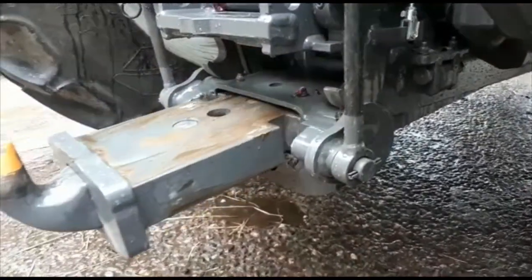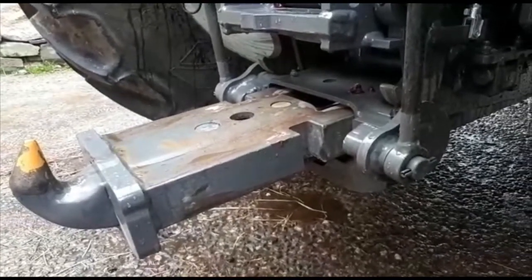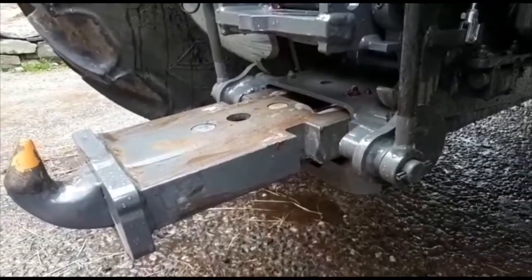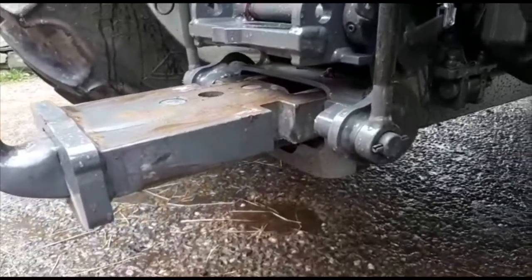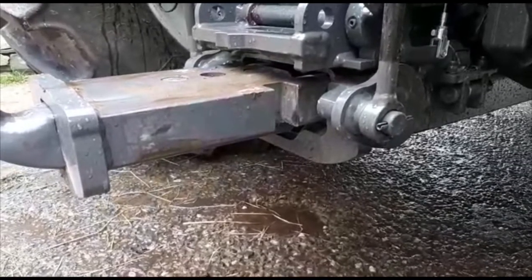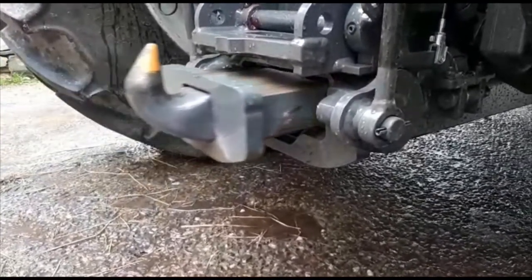You can now use the hydraulic controls and extend the pickup hook out to allow for better visibility. Once you're under the trailer or the hook in the implement, lift — you'll see the catches locate back in. Retract the hook back.